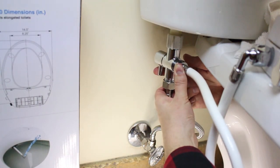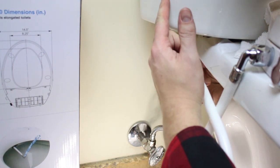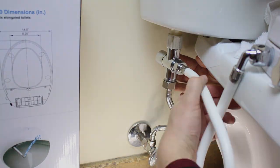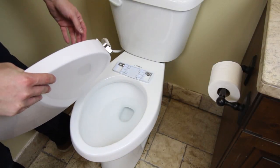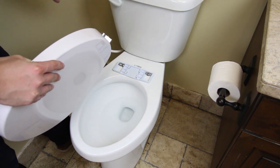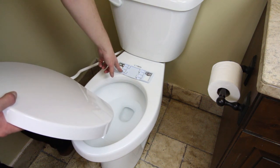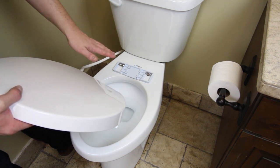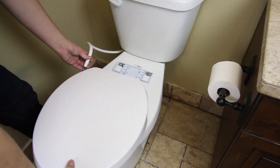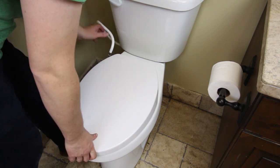Now with the on-off switch, down is on and sideways is off. It'll still let water into the tank, but it'll stop water from going into the bidet — stopping those pesky kids from bidet-ing your whole bathroom. On to the last step: I have installed the water supply hose into the bidet before putting it on the toilet. It just depends on the shape of your toilet. I've also tightened down the bracket so it's very secure, so when I attach the bidet, the bracket's not going to move at all. And here's the installation — it's very complicated, watch closely. And there we go, that is installed.